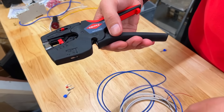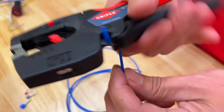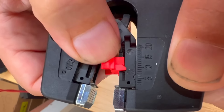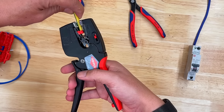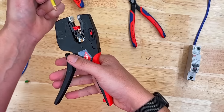In the in-between range, we've got some tri-rated switchgear cable here — great, great little cutter. Let's have a look at the automatic stripper function. We've got this depth guide here which allows you to precisely set the amount of insulation you're going to remove from the conductor. So let's try it on this 10mm² copper, which is the biggest size the stripper can handle — again, pretty effortless.